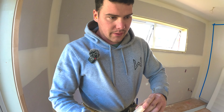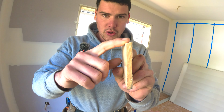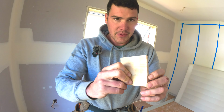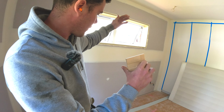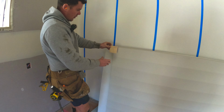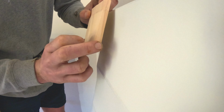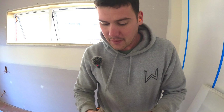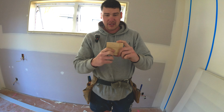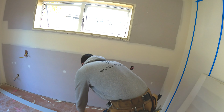Okay. Now we're putting a 90 by 10 single bevel skirting board on around the bottom. Now that's not going to work if I go to put the Laminex right down to the bottom, and if we have a look at this and then put the skirting board on the top face like that, it's going to look really ugly. So what I've thought about is I'm going to get a 20 by 90 piece of timber and lay it on the ground like this. I've already got one ripped up here.